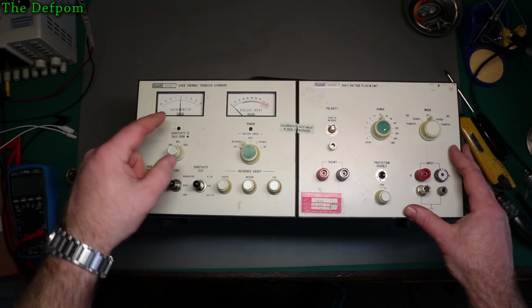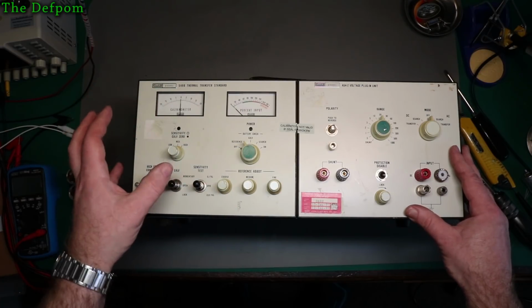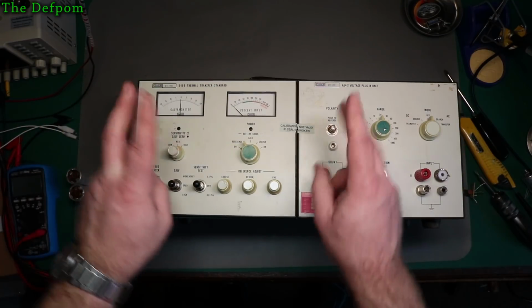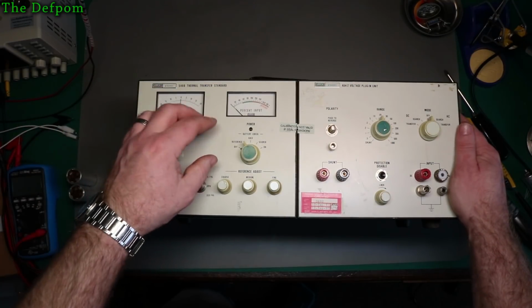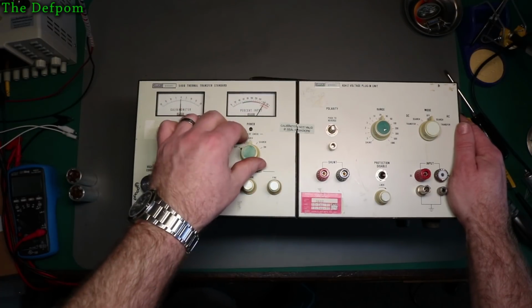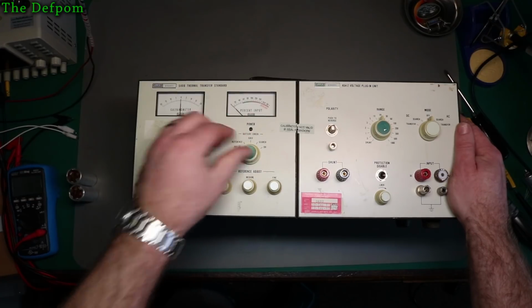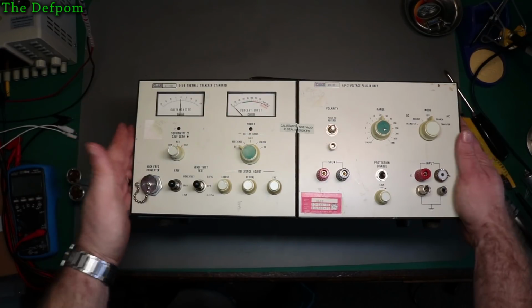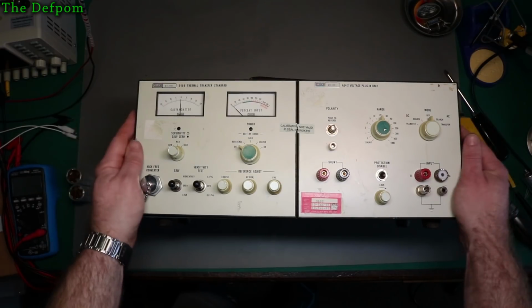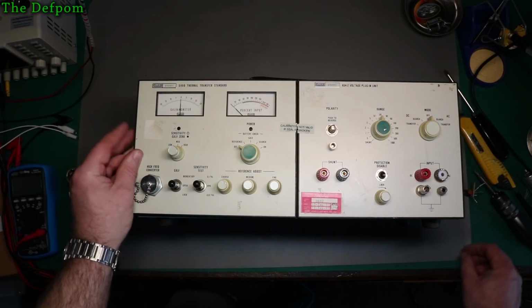The Mercury battery is inside it, which normally sits at 1.35 volts. You can't get those anymore because they're unsafe, and as a result there's no battery in it, and it's all corroded anyway. It has a battery pack which looks like it's actually okay because it still works, but I need to modify this to add a power supply to run at 1.35 volts to replace the battery, rather than having a battery backup in there.